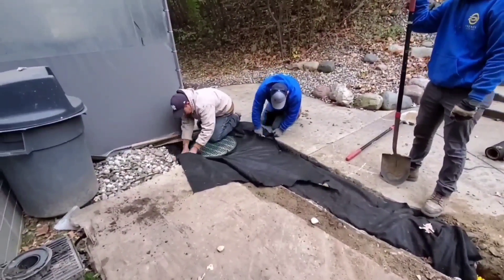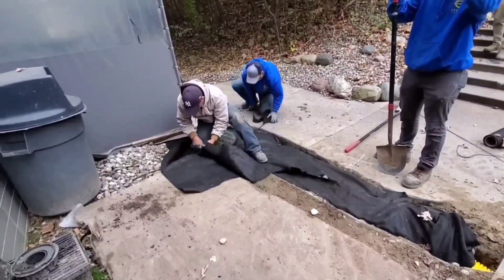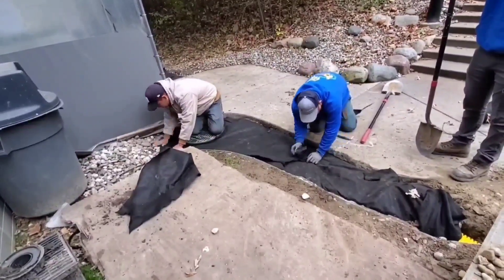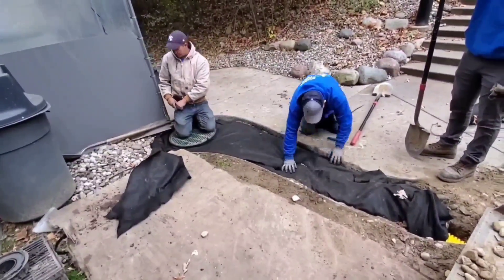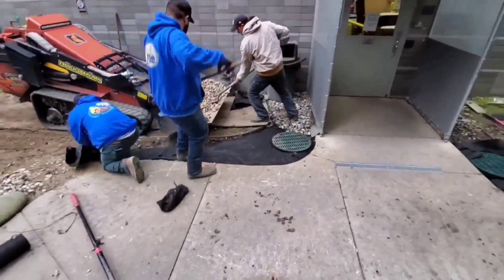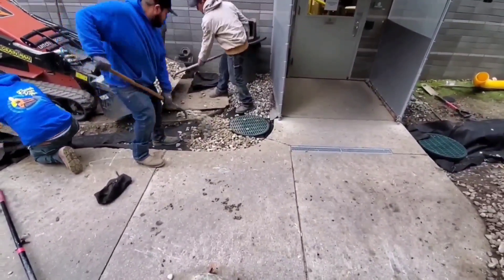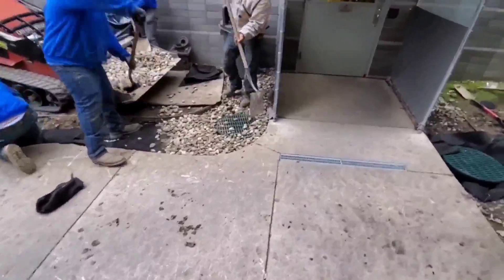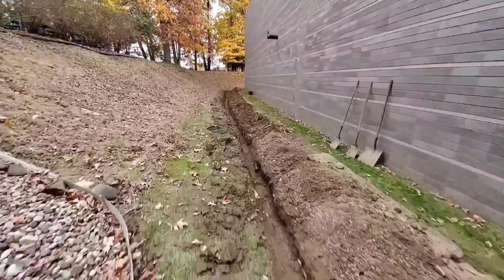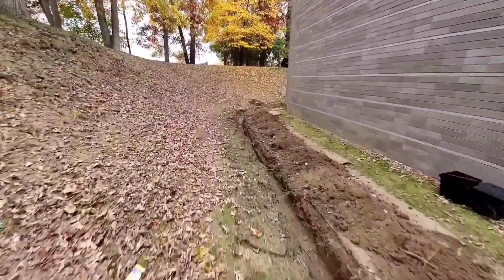The reason this works so well: if you put an open French drain around concrete set two inches below the surface, no water can build up on the concrete. I don't care how bad the pour is or if the slab settled — it's not going to make a difference. I have a drain on both sides of this piece of concrete. Water just falls into the stone and into the system. When water can't collect and build up on concrete, it can't flood inside the building. It's that simple. It was a beautiful piece of concrete — we weren't about to break it to fix the drainage problem. It was easily remedied.